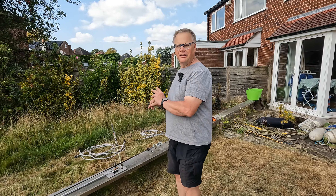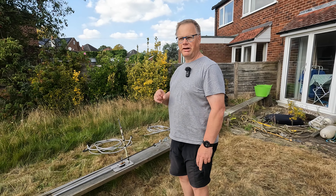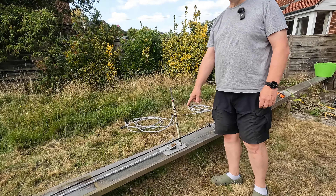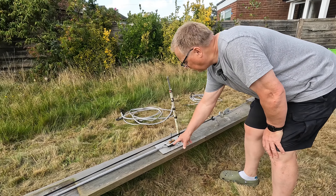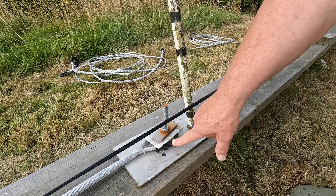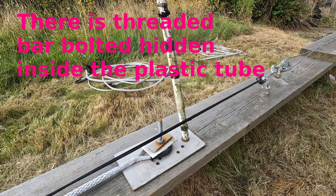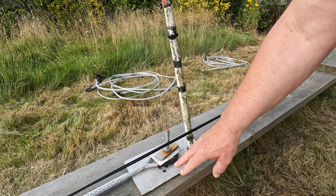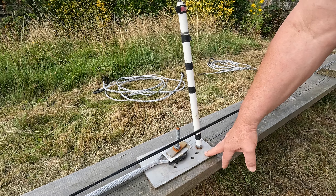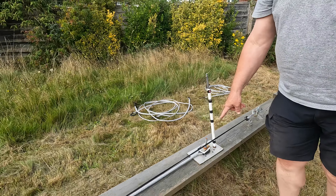Welcome to Sustainable Sailing - the garden project to stretch the constructional shrinkage out of our shrouds. We have here a simulated mast tang: a FR4 disc with the shroud around it and anti-chafe bolted to a plate, secured with a bent bar. The mouldy bit on the outside is just protection from chafe. This plate can just tear through the timber if it's not bolted multiple times - that's essentially the top of the shroud.